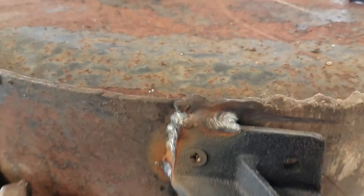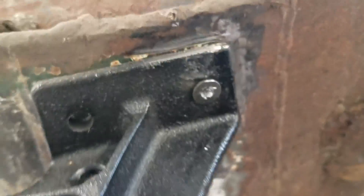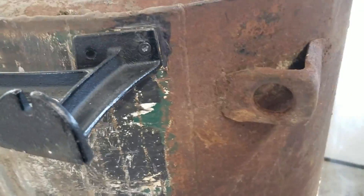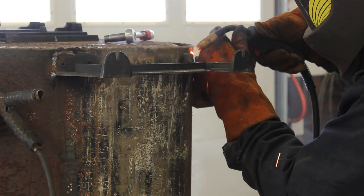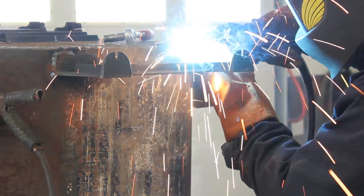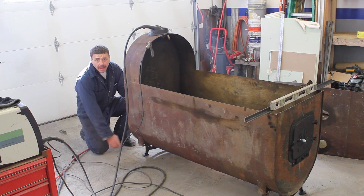The 55-gallon drum and the 275-gallon drum have two different diameters, so there's a gap there. I also found that trying to hold the screw on one side and put the nut on the other was a pain. So now that I've got the screws in place holding where I want it, I'm just going to give it a little tack weld to hold those in place — I'll do that to both sets.